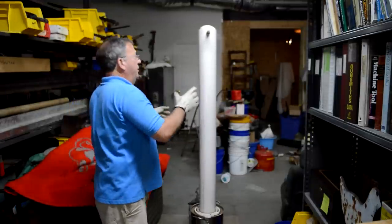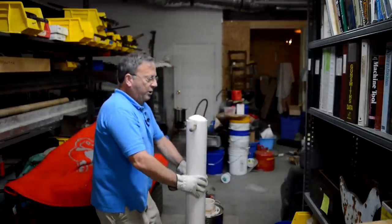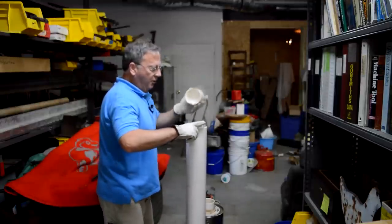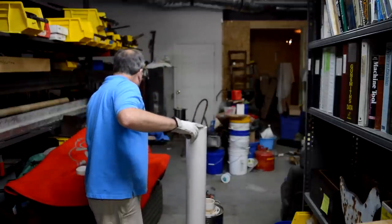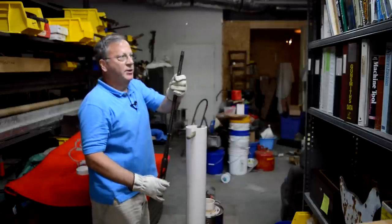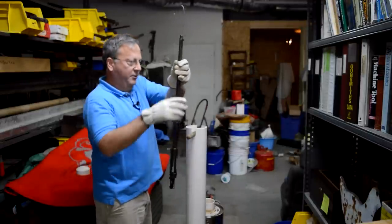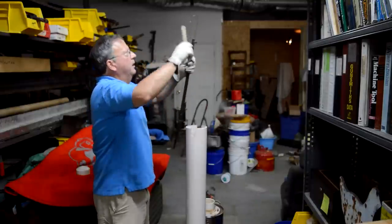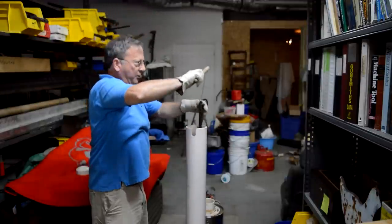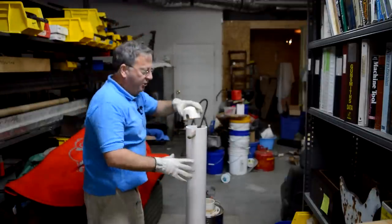So what we're going to do, first of all, before we start actually bluing, is convert as much of the rust that's on the gun to black oxide. So here's our 1916 Spanish. I put the coat hanger through the barrel and affixed it through the guard screw hole, and we're going to put it on our crossbar, our professional crossbar. Hang it, and try to get it kind of centered in the pipe.